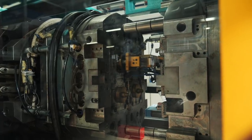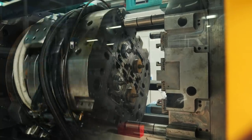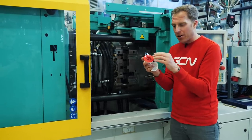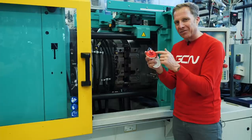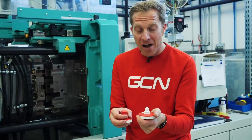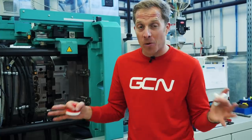This machine has a double injection mold that combines two materials. The bottom row of molds accepts the molten plastic and forms the basis of the lid. It then rotates and a top rubber-like substance is pressed into place — the heat of the two simply makes them join together. This serves two purposes: aesthetics, and a slightly grippy feel so when it gets wet it becomes a little sticky. The rubber nozzle or valve is pushed into place by machine, but a human has to line up the bottle top underneath before pressing the button. This process will also be moving here within a month.